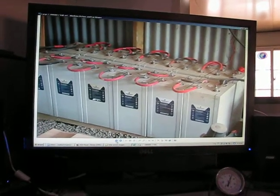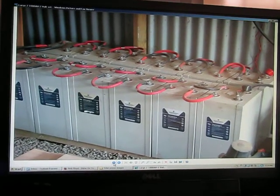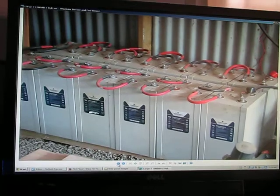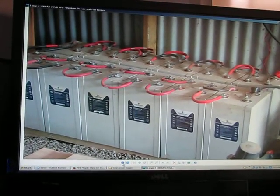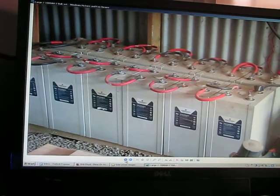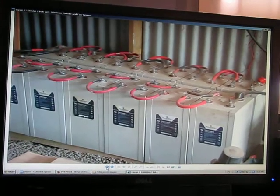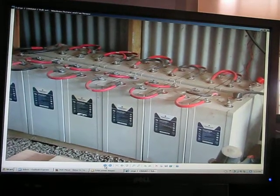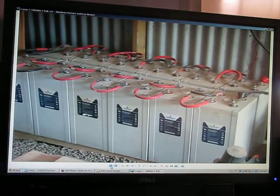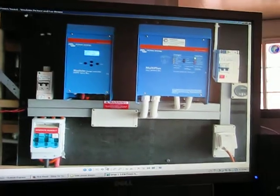Once you go up in size and scale, you wind up with big battery banks like this. A new battery bank — depending on which battery, type, and brand — will probably run you about $3,000 to $5,000, maybe $6,000 if you go lithium-ion, possibly even more. That one shown is 1,000 amp hours. You can also find them second-hand. It's a 2-volt system — each cell is 2 volts, 12 of them, which gives 24 volts. As you go up in voltage, costs multiply: going from 12 to 24 volts pretty much doubles your cost, and 24 to 48 volts doubles it again.